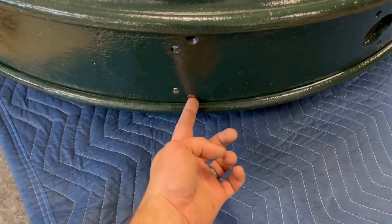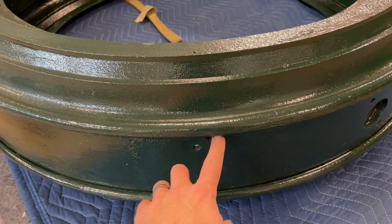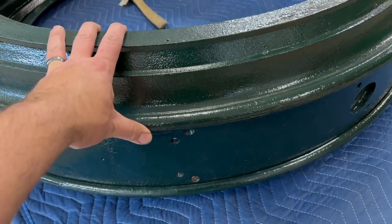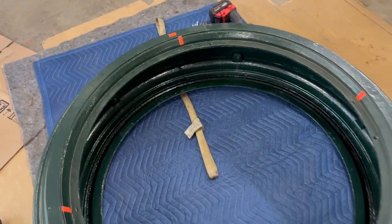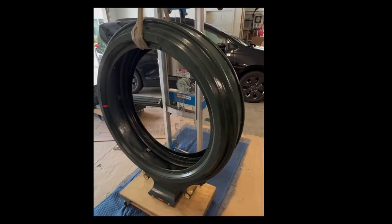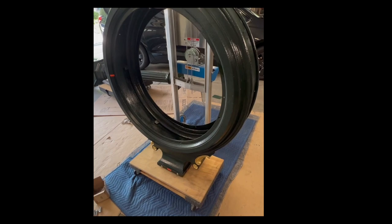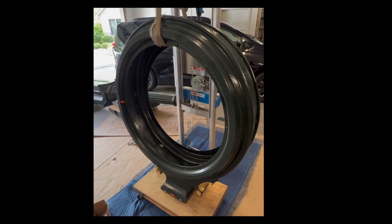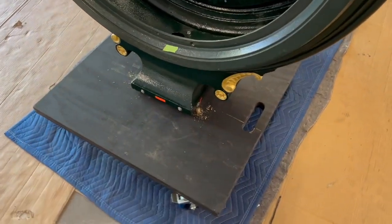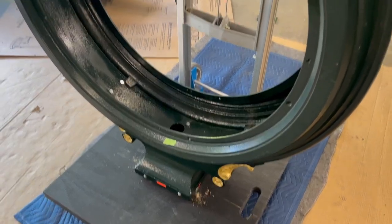What's now the bottom bezel is attached to the ring with silicon bronze fasteners, and now we're just working on lining up the other side of the inner bezel. When these are lined up, we've got a lifting strap underneath and we will set that up onto the saddle using a material lift. We have the main ring set on the saddle and will get it bolted up, then put the crown on top. We opted to increase the size of the caster board for a little more geometric stability.